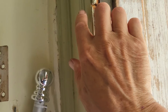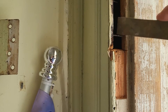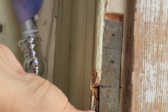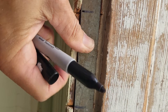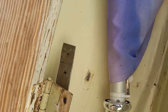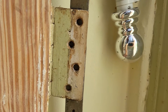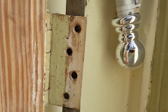I'm going to put a block of wood in back here — fill this in with a block of wood. I've got to cut these out and fill two holes there and two holes there. This is where the hinge goes, so I have my mark here and one down here. I'll take this, put it right here, mark it, pre-drill, and go ahead and take care of that.